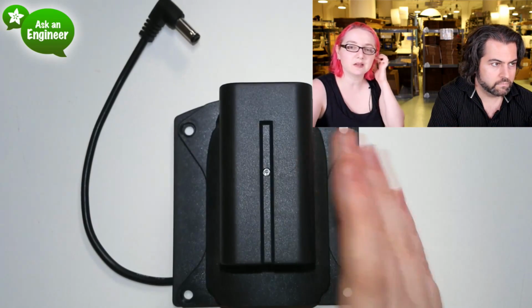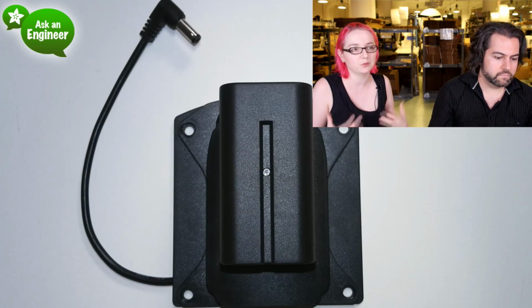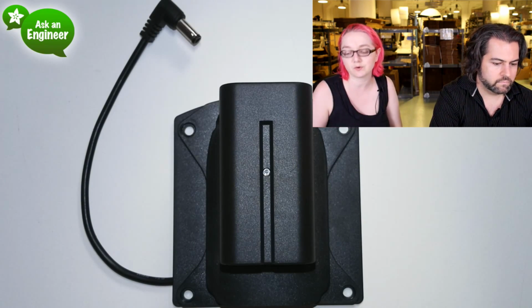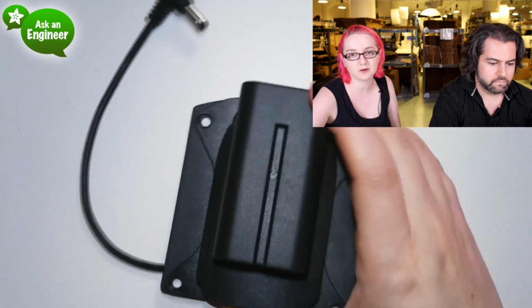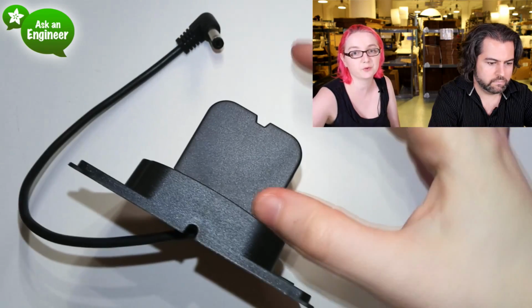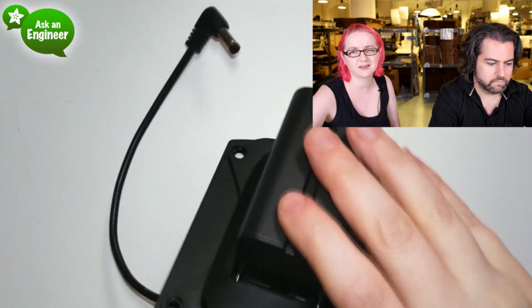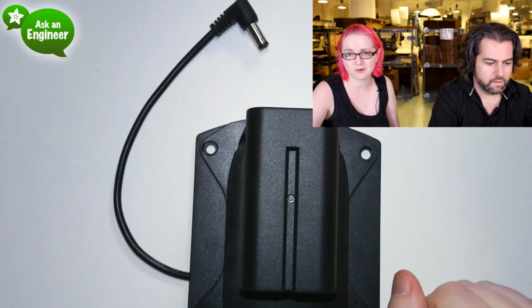Basically, you want to have a rechargeable lithium-ion solution that can give you more than 5 volts DC, or you want to regulate down to 5 volts. This works quite well, and you can get batteries that are, this is the double thickness ones, but they have ones that are half the thickness, and there's also ones that are even thicker for like 10,000 milliamp hours, so like crazy amp hours. Okay.